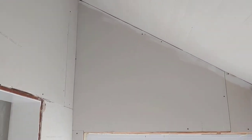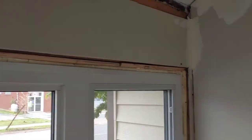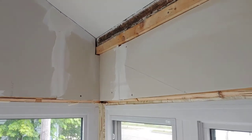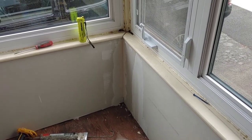The drywall is done, coming along nicely. Got one coat of mud everywhere — one light coat, got all the seams covered up. I fill the crack first then come back with tape. Got the corners taped — went pretty good, it's just a small room. One coat of mud — going to walk away, let it cure, come back tomorrow and do a second coat.